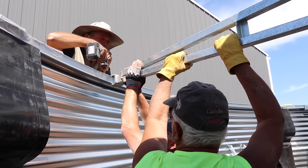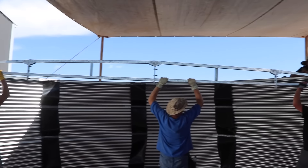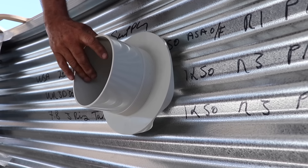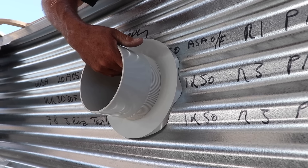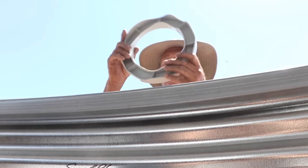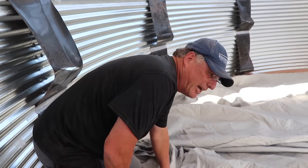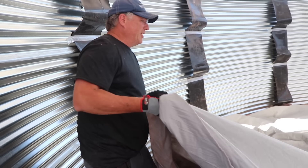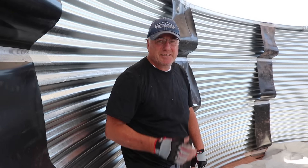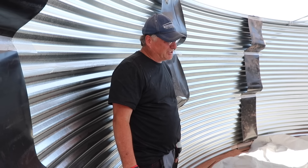As you see it go together, it's really not that complicated, but it's not necessarily DIY-friendly for a first-time installer. This is the six-inch overflow fitting — it fits perfectly into place and a washer on the outside holds it in position. The carpet layer going down on the base protects the liner. In other parts of the country they use crushed granite — quarter inch or less — to protect against angular stones that could damage the liner.